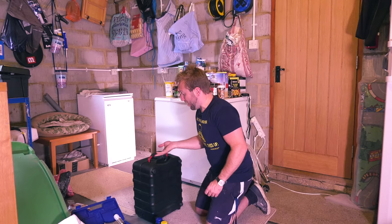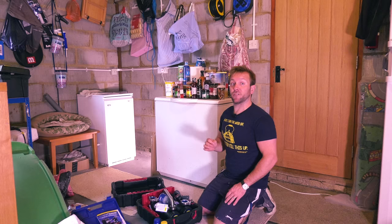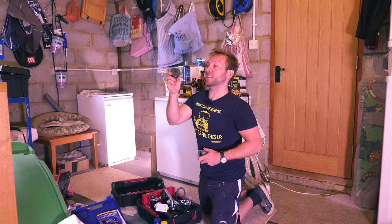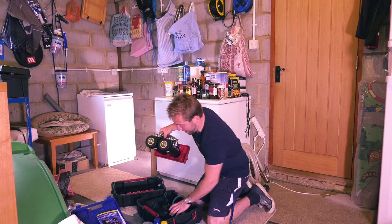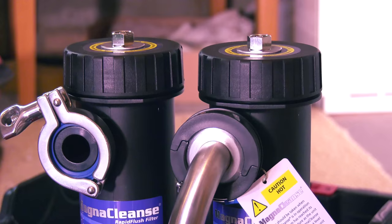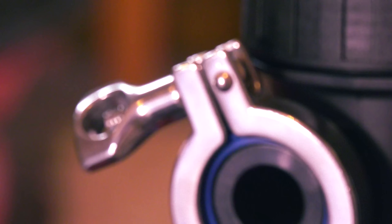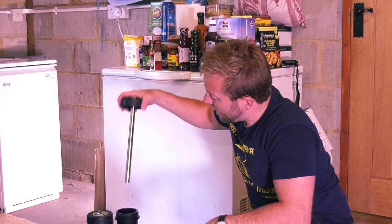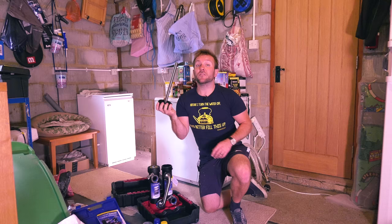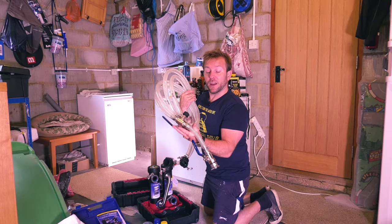Let's have a quick look at the fun part of the box - twist cap, pull up, and then it lifts off. We've got our little radiator agitator, which goes onto an SDS bit on your SDS drill - we'll be using this later to shuffle any stubborn bits of magnetite about. Then we've got the beast itself, the magnets. Whatever you do, don't take two of these out together and get them stuck - they are so hard to get apart. Behind me we've got two hose lengths, about two and a half metres each, and also a little drain cock.